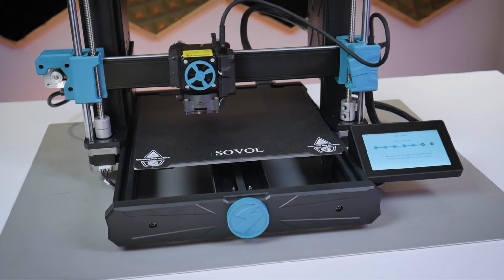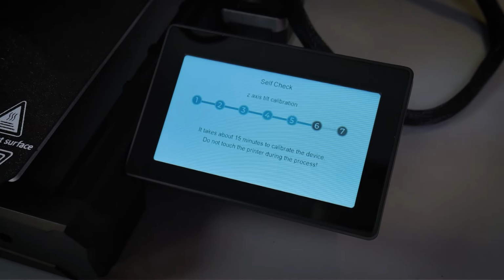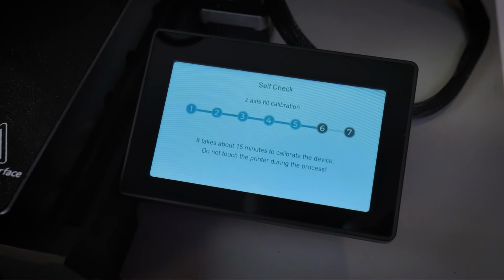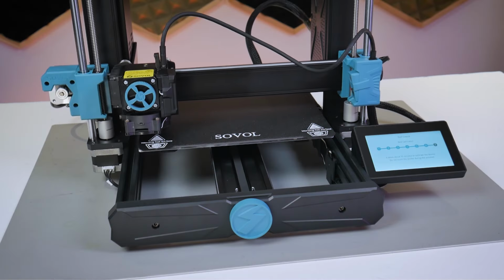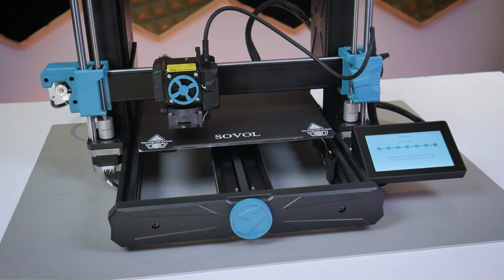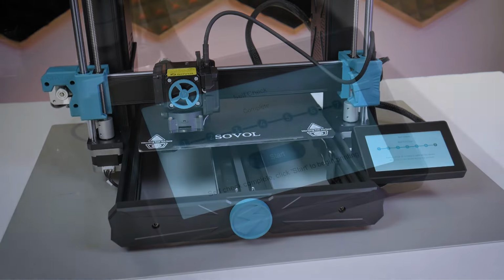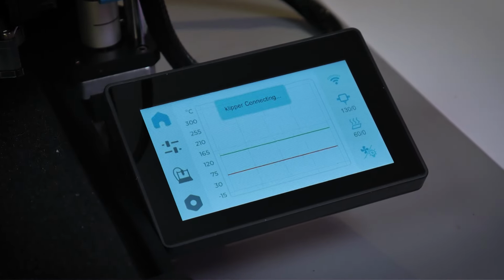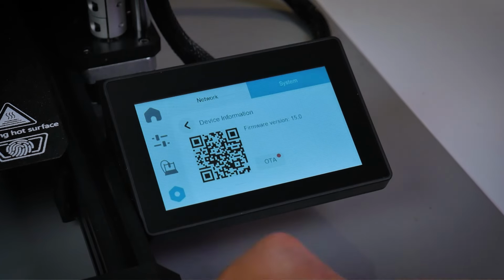However, the one thing that I was most intrigued with was the Z-axis tilt calibration. Most gantry-style bed slinger printers these days have 2 vertical lead screws that are belted together to keep them synchronized. So if the gantry comes tilted from the factory, then you'd have to line that up and square it to the machine frame manually. On the SV06 ACE, they're independent and driven by 2 separate motors, so it looks like the machine is able to calibrate for that tilt automatically.